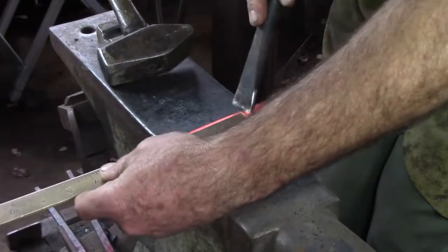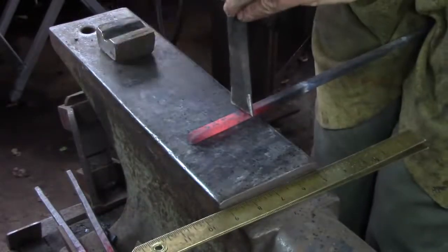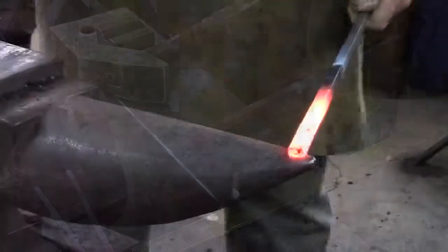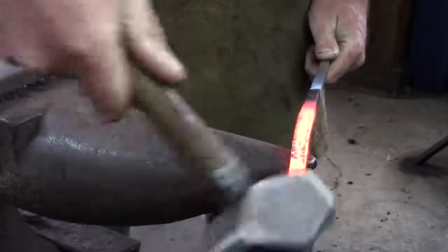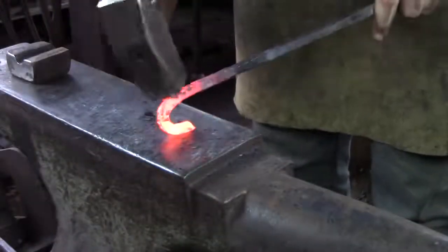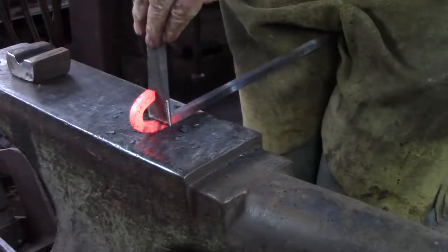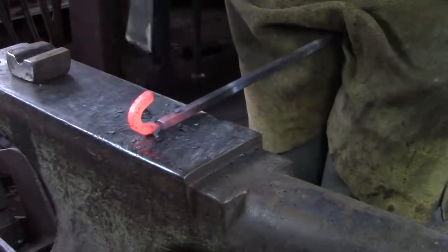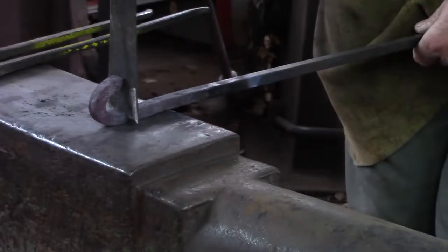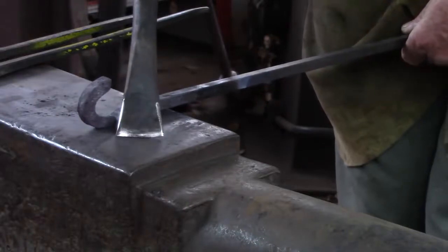I'm going to come along here 2 and 7/16 — actually, I'll make mine 2 and a half inches. I'm going to make a chisel mark, something I can find later once I've bent this collaring material around into a horseshoe shape. When I make my cut for the collar, I go to about a 16th of an inch thickness, and I'm looking at the sides of the chisel — the daylight there — to give me that indicator, bearing in mind that the working end of my chisel is crowned, not flat.